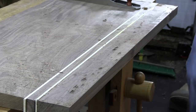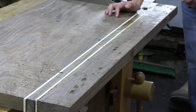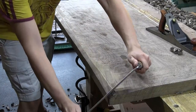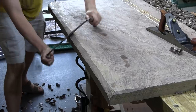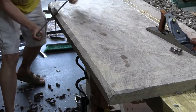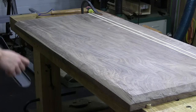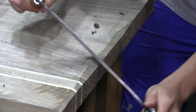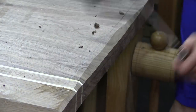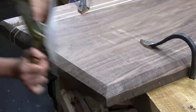On the bottom of this, I want a one inch by one inch chamfer all the way around the perimeter. So once I mark it out, I'll remove the bulk of the waste with a draw knife, and then finesse it right back to my lines using a jack plane. Now across the grain is the same story, but I use a heavy skew on the draw knife and the plane, and this ensures I get a good, clean, finish-ready surface.